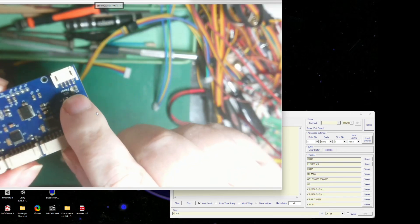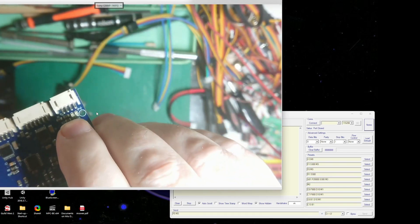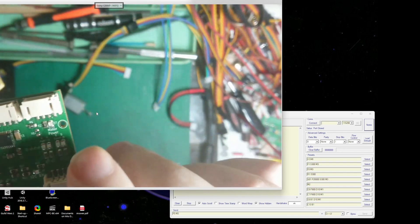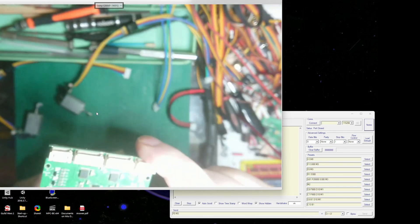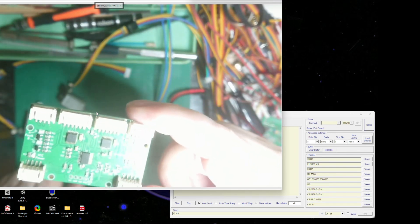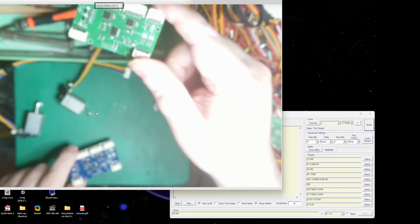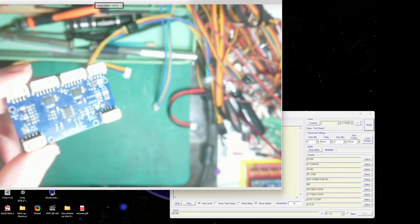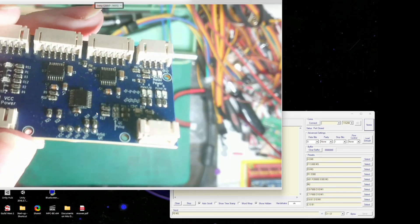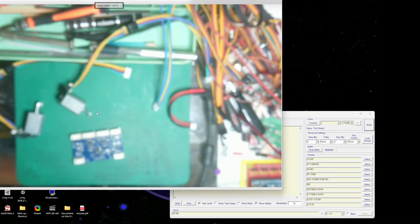So the way to tell the difference really is those two LEDs versus only the one LED. I still use the version one - if I'm not using encoders there's no issue. Even with encoders, I just have to remember with this board that I can only move one motor at a time. But hopefully with this new version we can now send commands to both motors to do different things.